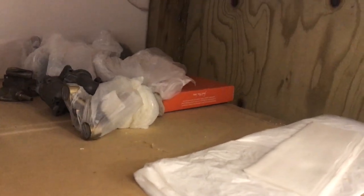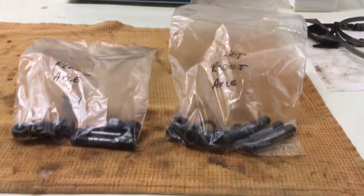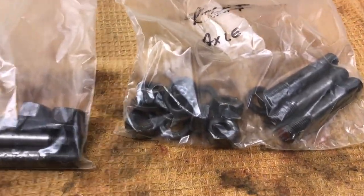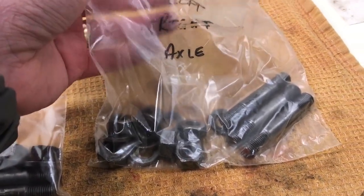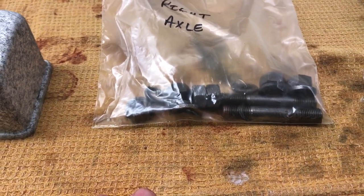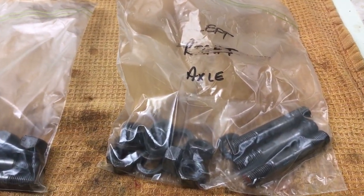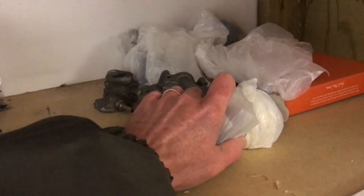This afternoon I've been organizing all the bits into these bags. Having cleaned everything, they're nice and clean — I've put them in these bags, labelled them so I know what they're from, and sprayed a little bit of duct oil into each bag to keep them from rusting or corroding until I'm ready to reuse and repaint them. That seems to be working quite well. There's a lot of cleaning to get through — anyone who's done this before will know that — and here we've got the old TVO tap, which we've seen in a few videos, wrapped up and ready to go.